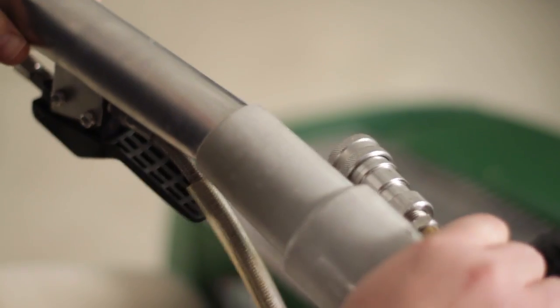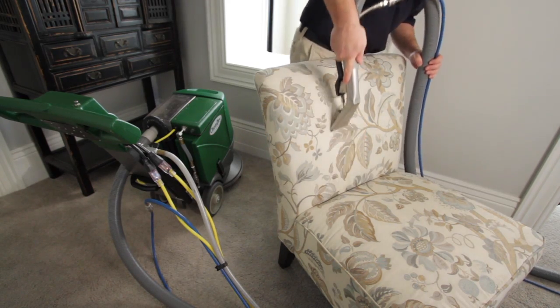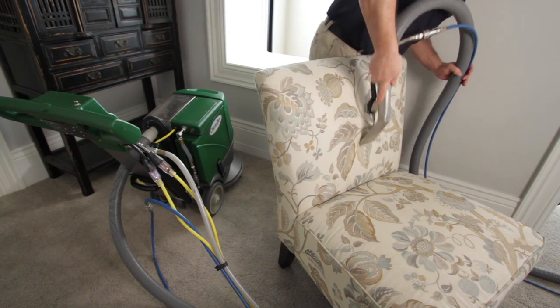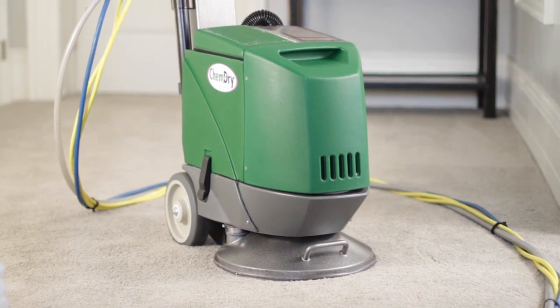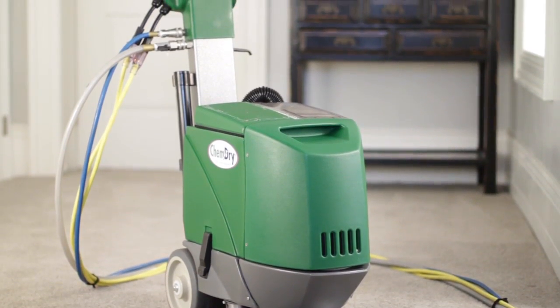As a side note, avoid prolonged dry extraction with the accessory tools, as the vacuum is designed to vent through the bottom of the XTS powerhead bell housing, and when the extraction hose is dry, it could create a cloud of dust in the room.